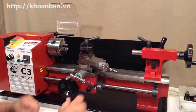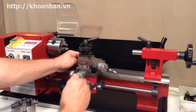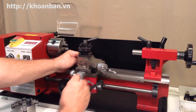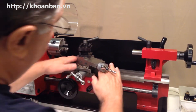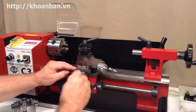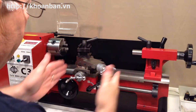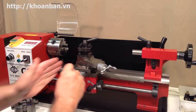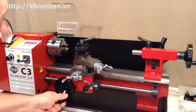Just a few more terms: on top of the carriage assembly here we have two sub-assemblies — three, really. The first is the cross slide hand wheel. The cross slide is this sliding base here that moves perpendicular to the ways as I move this hand wheel. It's used to advance the cutting tool into a workpiece to reduce the workpiece diameter.